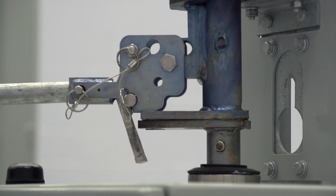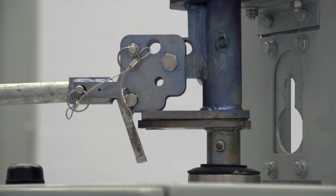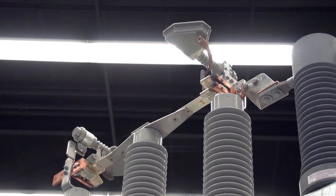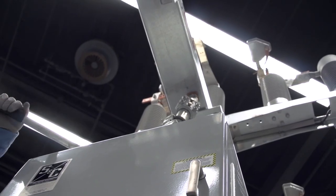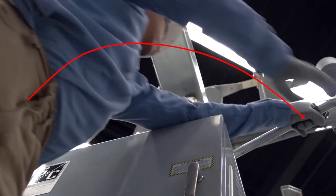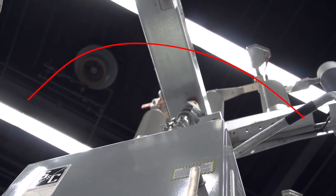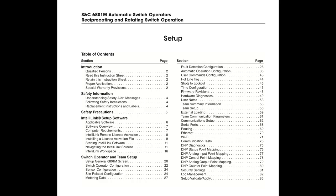Now use the manual operation handle to place the switch in the closed position. Note the direction of travel. A rotating switch operator is factory set to operate clockwise from closed to open. Operation can be configured to operate counterclockwise when the switch requires it. See the closed direction set point in S&C Instruction Sheet 1045M-530 on page 23 to configure the rotation device.